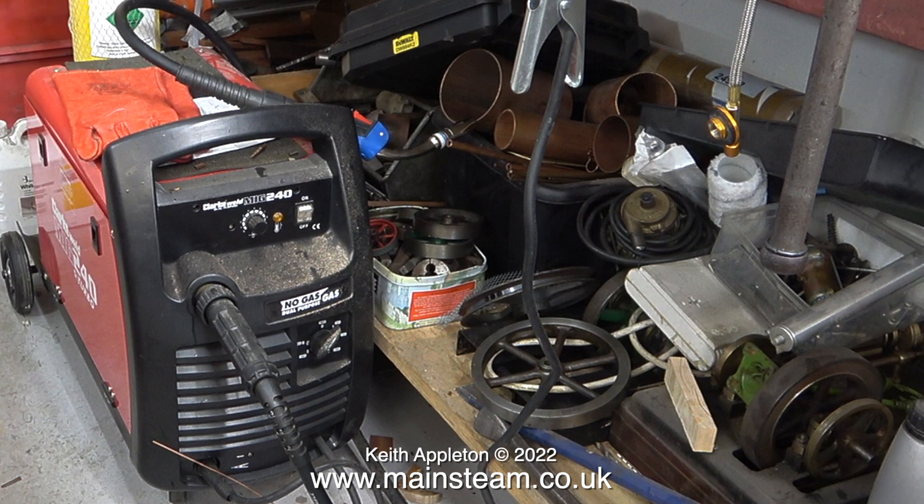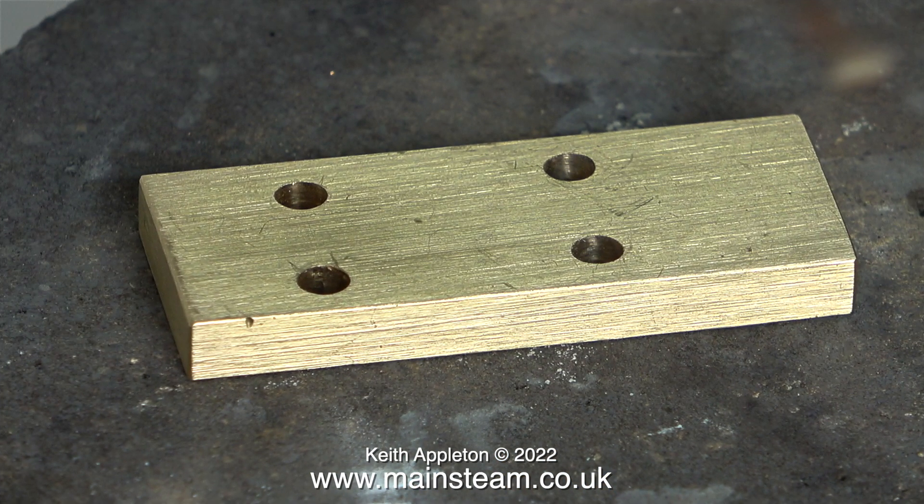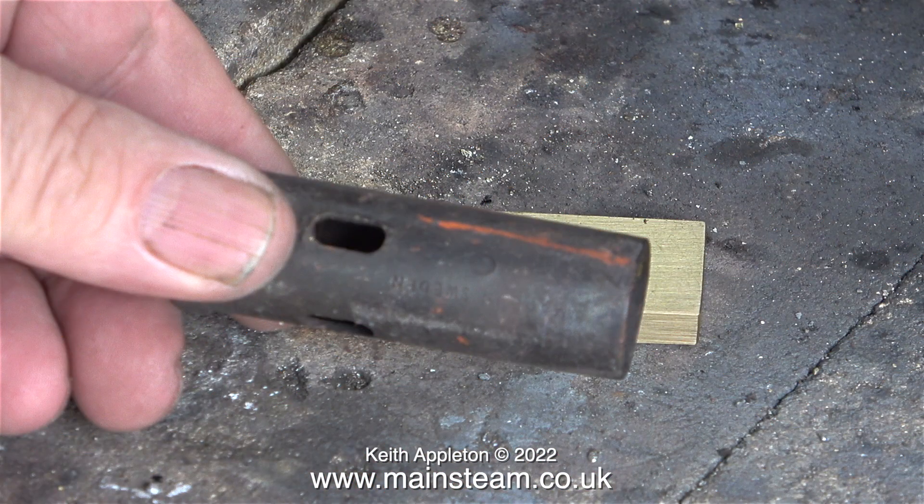There are different ways to fix holes in the wrong place in pieces of metal. Had this mounting base been made of steel, the fix would have been simple — I could have used my MIG welder to block up the holes. But the part is made from brass. Another option would be to drill and thread the holes and plug them — 3/16ths is the tapping size for 2BA — but I'm not going to do that either. Necessity is the mother of invention, so I took the piece of brass into the outer part of the workshop, sat it on the brazing hearth, and fitted a larger blowtorch head.